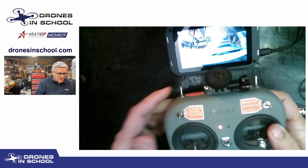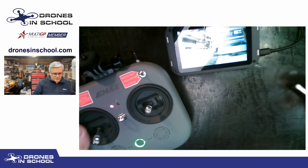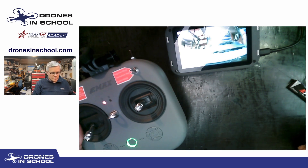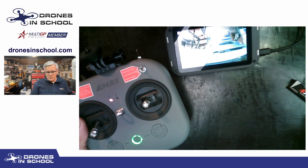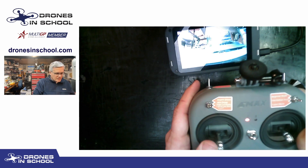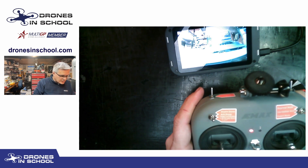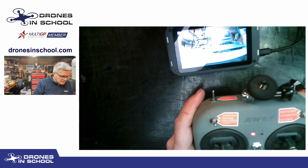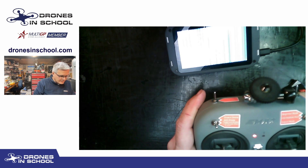These little HD Zero drones are really fun but you'll notice the video transmitter gets a little warm — a little toasty. So another thing you can do is stay in pit mode more to shut the video transmitter off. You can go into the menu and turn on pit mode by setting it to zero milliwatts, then save and exit. Now the drone's video transmitter is off.